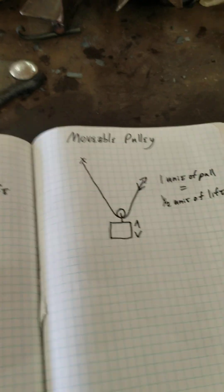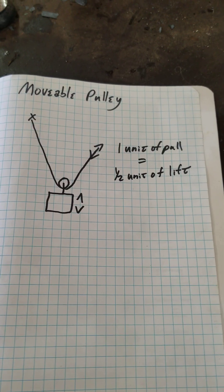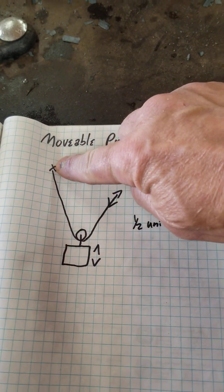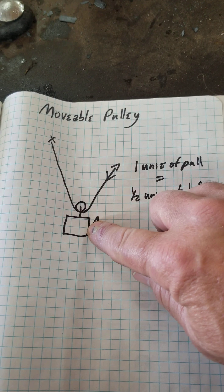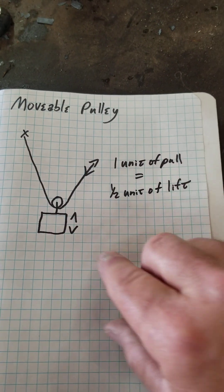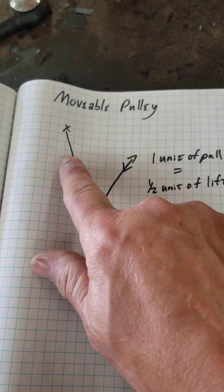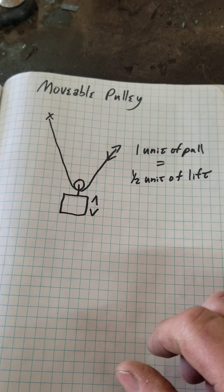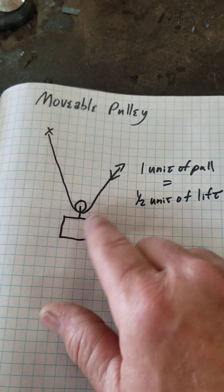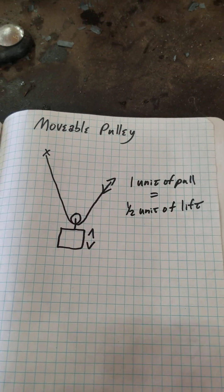My system on my hammer is considered a movable pulley, and here's where the differences lie. If you grab one end with that end being fixed and the pulley attached to the mass, if you move one unit of distance, the mass only moves half a unit of lift. But the benefit is each half of the rope on either side of the pulley is only lifting half the mass — so each half lifts 25 pounds if the mass is 50 pounds, halving the effort required.